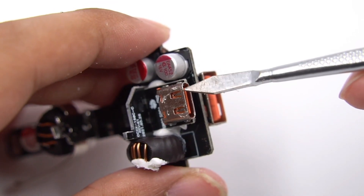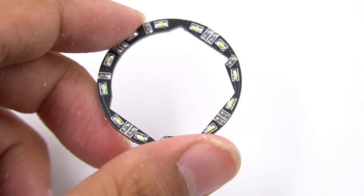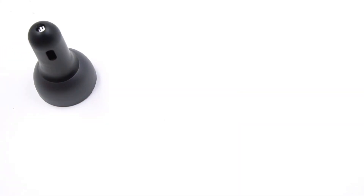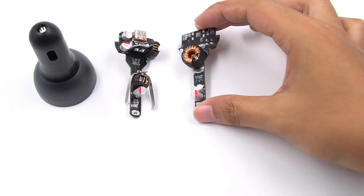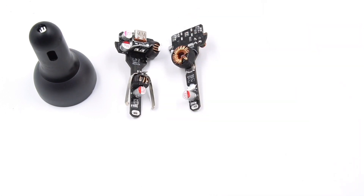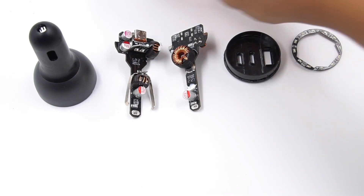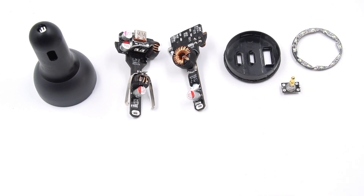The USB-C2 port is soldered on a small vertical PCB between the two main PCBs. Finally, a total of 12 LED lights are on an additional small PCB. The car charger is composed of five small PCBs, with three independent buck and boost circuits across two main PCBs. The iSmartware SW3522 for USB-C2 and SW3521 for USB-A are highly integrated, allowing them to share one PCB and reduce overall size. Thermal pads on the PCBs also help dissipate heat and reduce temperature.